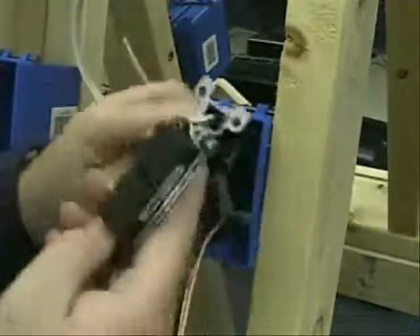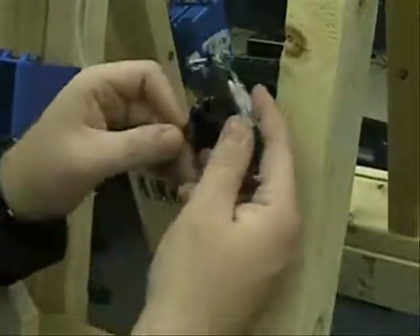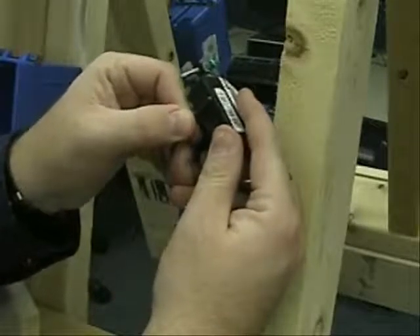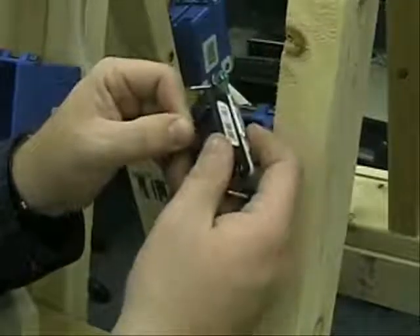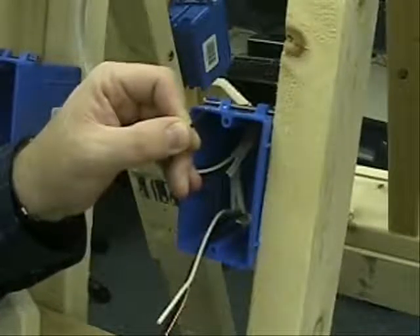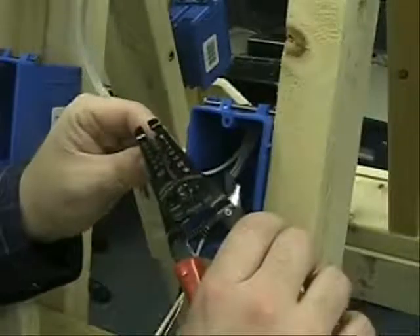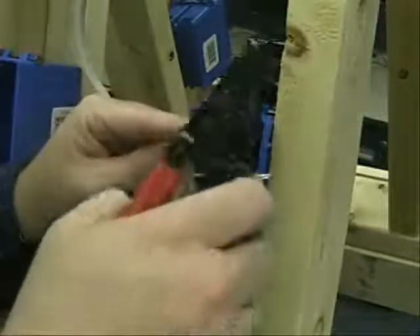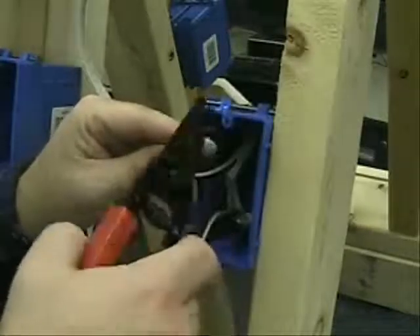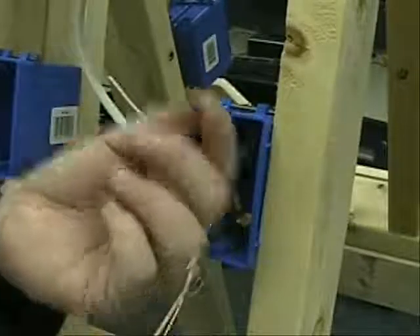If you strip a little bit more insulation than the gauge shows, you can always cut the wire a little shorter — that's usually what electricians do. So I'm going to take the black wire first and hold it up to the strip gauge. I'm taking about a half inch off. I'll find the 14-gauge slot on my wire strippers, clamp them right in, squeeze and then gently wiggle, and off it comes just like that. I wasn't squeezing down very hard — I was releasing the pressure a little as I went — and you can see the insulation popped right off.